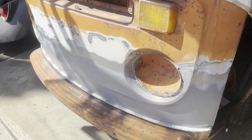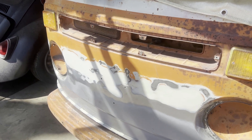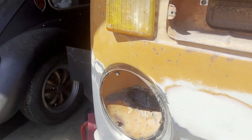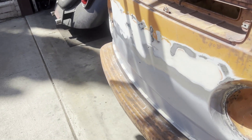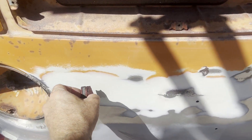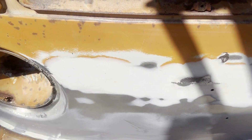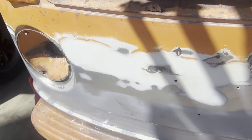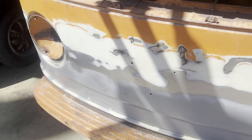Don't look. It's ugly. Forgive the shadows. Another pass with a layer of Bondo — I'm liking this a lot better. It's still going to have a bit of a wave in a few spots, but I'm cool with that. I will have to put another layer of Bondo there and there to get rid of some slight imperfections in the line, but overall I'm pretty pleased. I also passed what I refer to as the magnet test — this is the spot where the Bondo is the thickest. The magnet still sticks, so it's not so thick that it can't reach metal underneath. On my little Jeep there was one section that had a half-inch thick layer of Bondo — no joke. At least I'm not doing that.